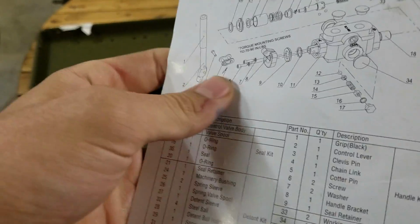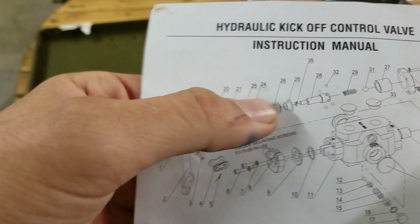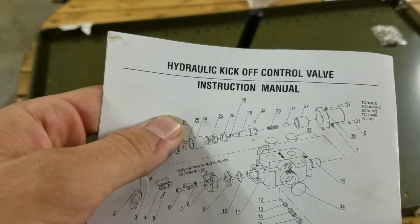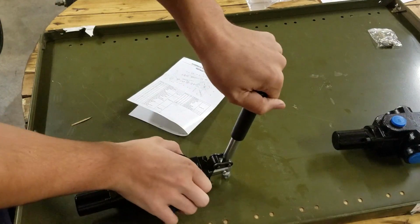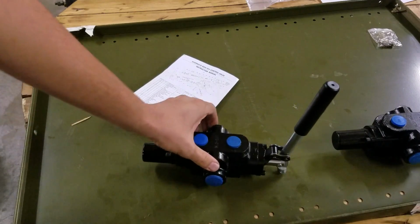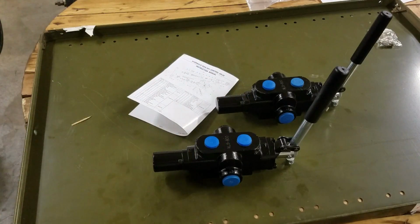So what I did was, the valves came with this manual type thing here, and I started looking at this diagram. It gives you a nice diagram of every part and component that goes in here. I saw right here is that detent. These four little bearings, this spring and this bearing, is what locks into place in that one direction. So I opened this up and took those four small bearings, the spring and the bigger bearing out, and now this can move freely both directions, just like I need it to. I'll do a separate video, link in the description, showing how I already did it on this one. I'll do it on this one as well and show you exactly how I take it apart and what I do.